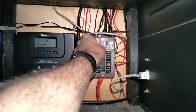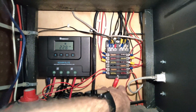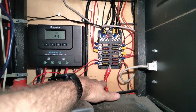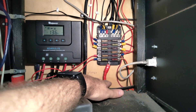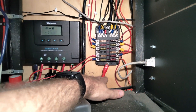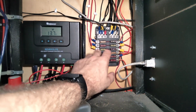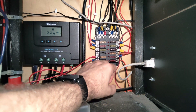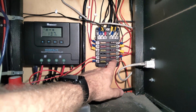Now let's have a look at our fuse box. You'll notice we have massive wires coming up — I think it's probably a 1- or 2-gauge wire. It draws enough that I can basically run a boatload of current through this. The reason I have so much power coming through here is I have wired nearly every computer system and everything in this van to run off 12-volt. I'm actually using all of my circuits except one — I can put one more thing in this fuse box. The currents all add up nicely, so I'm not really stressing the fuse box.